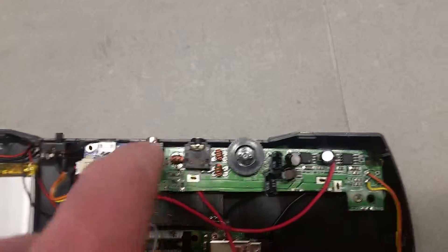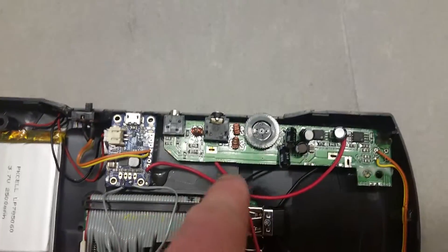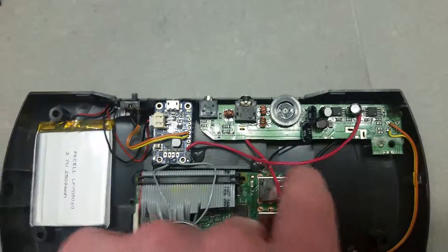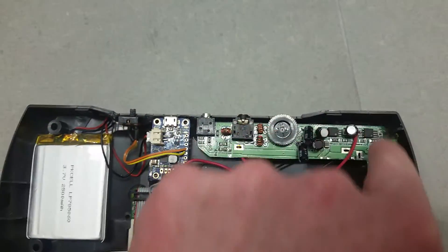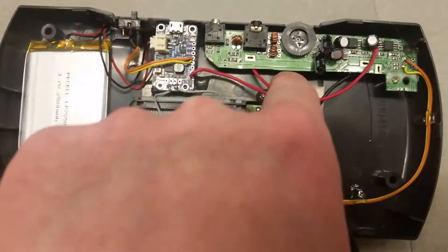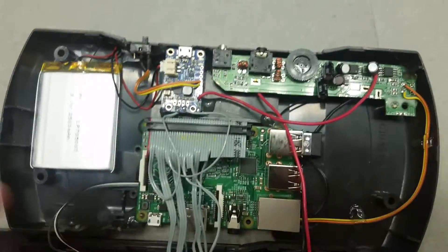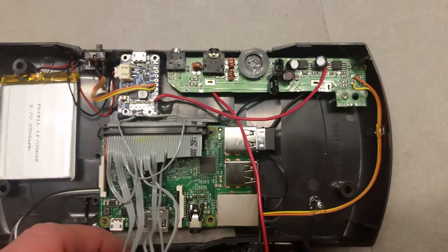From the amplifier it heads to the headphone jack. I've wired the speaker positive out to one of the pins on the headphone jack, and there's also a ground point — there's actually a ground bus that runs along the outer rim right here. I soldered two different ground wires to that trace. One goes to the underside of the Raspberry Pi at the headphone jack line out. I found that if I use ground on another part, like on the GPIO header or elsewhere on the Raspberry Pi or the power boost, I get signal problems and a lot more noise. Other people have said the same thing — the Raspberry Pi is a little trickier for audio.